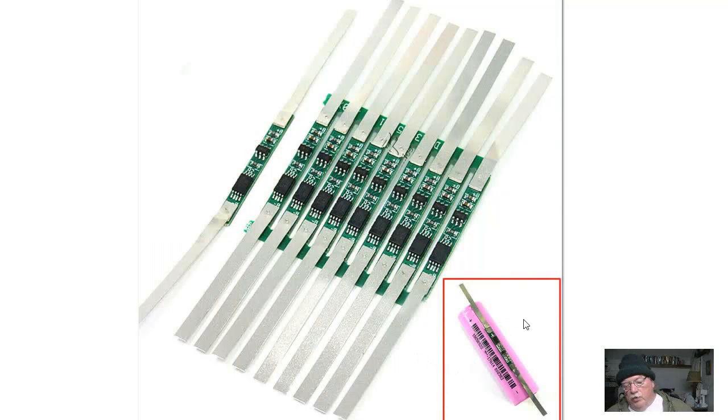These are interesting and very inexpensive. As you see in this illustration, this is an 18650 bypass circuit — this one is good for bypassing 2.5 amps. I bought them off eBay; you can get them at a higher rating, but I did not need that. You observe the polarity that's marked on it.